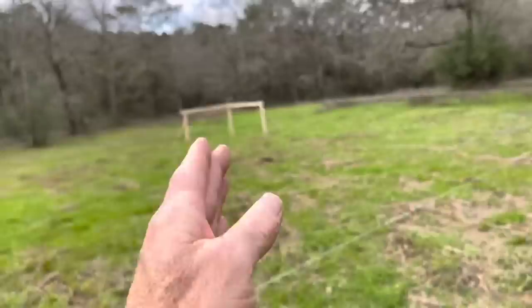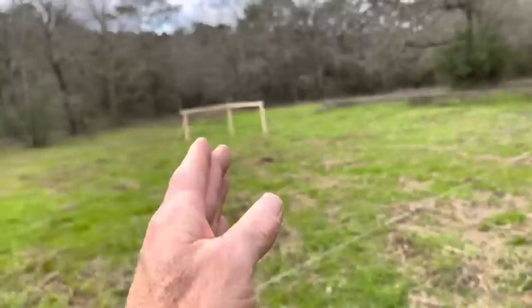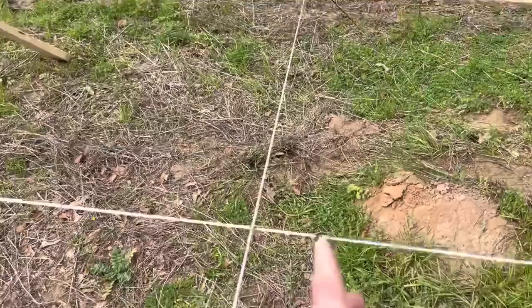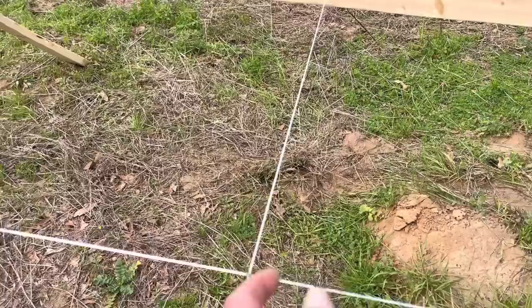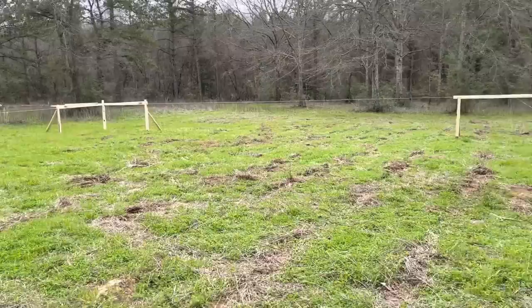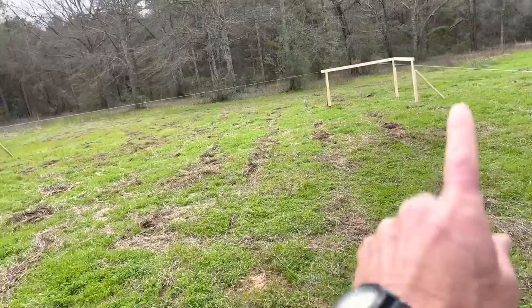I did the cross measurement and it turned out just perfect. The 68-foot mark that I made on this corner and that corner off of these two corners was two and a quarter inches from being perfect. So all I had to do was measure over two and a quarter both ways on both sides, and I put my line. There it is — I got her tighter than Dick's hatband. It's going to look good, y'all. When I'm running the pillars in the middle, I'll just run batter boards on the outside of this — I just didn't want to have to dig around those getting this outside perimeter dug. Y'all hang in there. We're going to get it. Appreciate y'all.